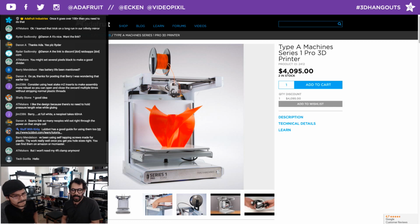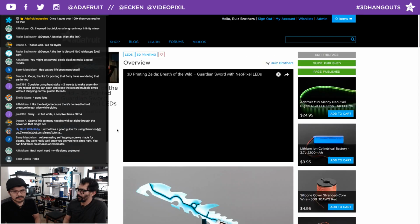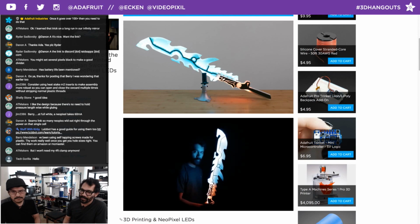Okay. So the tolerances that I have for the standoff are in such a way that the layers actually create the threads for them, because I'm using a 0.25 millimeter layer height. It actually does really well. They're practically printed with the threads in them because of the layer height. Right. So good thing. It was by luck. I won the maker lottery on that one, where it printed tapped. That's good. So there's no forcing to create the threads, which is something I should have highlighted, because I was super surprised and happy when I was able to just screw that in there without any force.